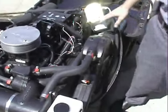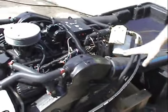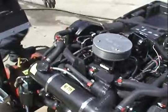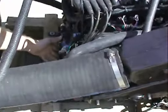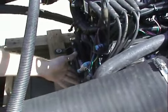What makes this special with the VR1 is that we're using a 12 and 3-quarter inch flywheel and a 12 and 3-quarter inch starter with the flex plate. So for your older 270, 280 Volvo OMC drives, this will still bolt up. There's no adaptation required right here.